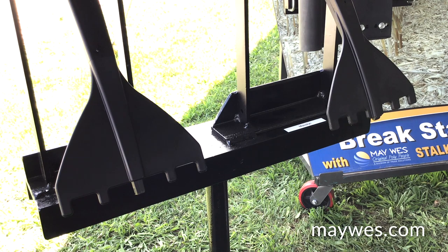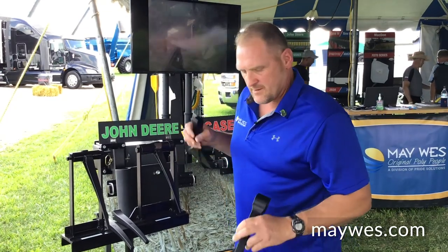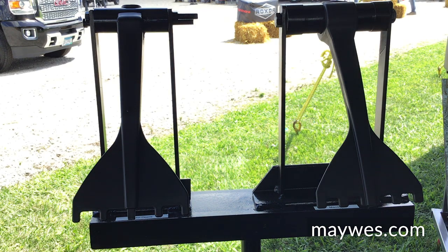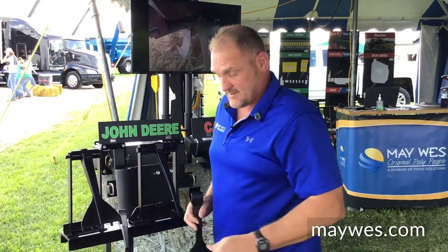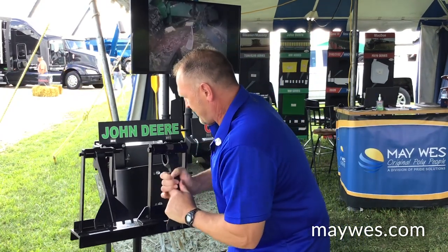The five-finger Quick Tine is going to come in two different manufacturer fits. The first one is for the John Deere 6700 FD series. The other five-finger is going to fit the MacDon FD series, Case IH 2100 series, and some of the New Holland 83, 82, and 86C models. Short beans, wind damage, specialty crop — you name it. No tool is required to put this five-finger Quick Tine on. It's just a matter of sliding it over the existing finger and locking it right into place. Same thing with the MacDon, Case IH, and New Holland style — just snaps right into place.